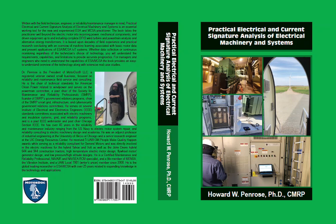My first application surrounding the use of ESA was in 1994, troubleshooting an electric motor at a petrochemical facility in northern Illinois on a Sunday. I had experience from the U.S. Navy in the mid-1980s and had just completed additional training in vibration analysis. The customer had a problem with loading a 4,160-volt compressor motor as it would trip on over current. I was utilizing an IRD fast-track data collector and had obtained information on the stator slots and rotor bars for the machine. With the relatively low resolution of the screen, I noted a 3,600 cpm and 7,200 cpm peak in velocity, as well as others that were inconclusive, so looked at the higher spectra and acceleration.